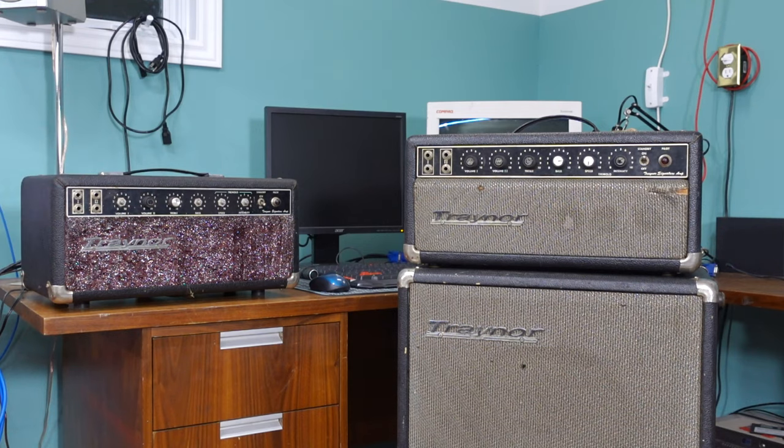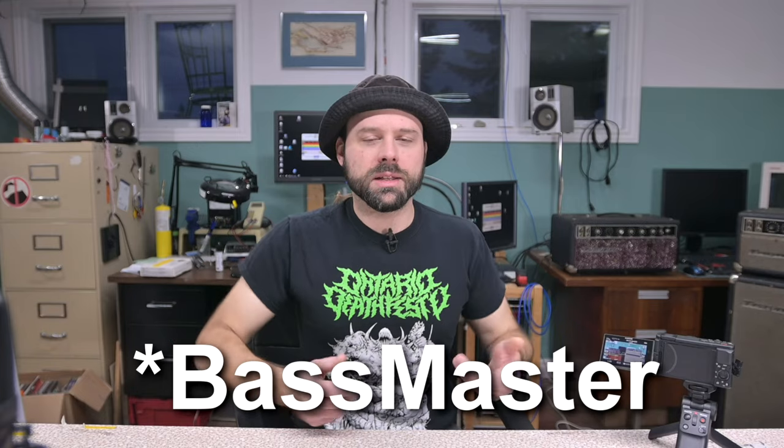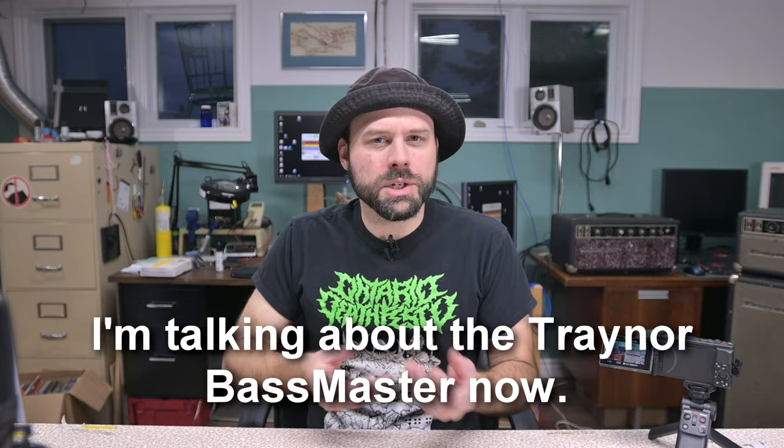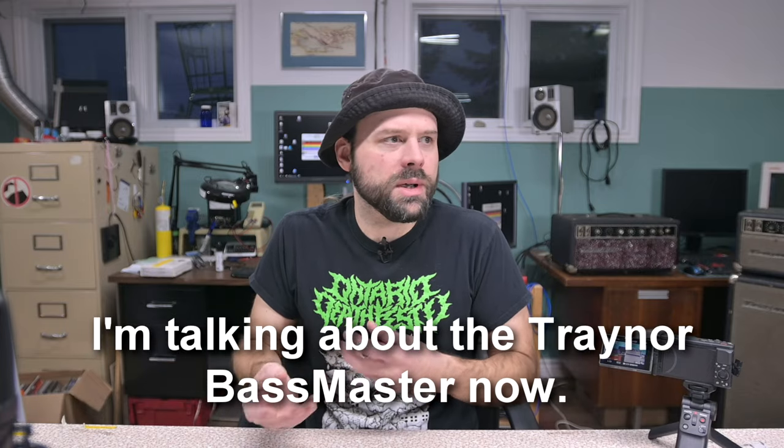The signature amp is very similar to the Bassman — best I can tell it's almost an identical preamp circuit. The two major differences are a different power supply: the signature amp has what appears to be a better-designed power supply, specifically in the standby section, and it has a lower voltage power supply, more equivalent to what you would see in a vintage guitar amp. The Bassman had a higher voltage power supply so it could get more wattage per amperage, and even though it was technically a 45-watt amp, with the right tubes you're easily getting 80 watts out of it.